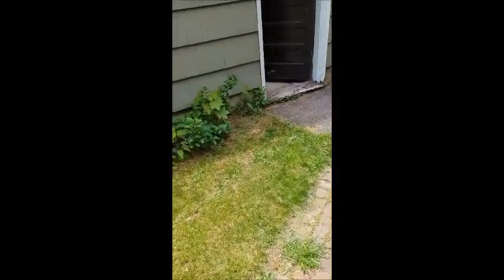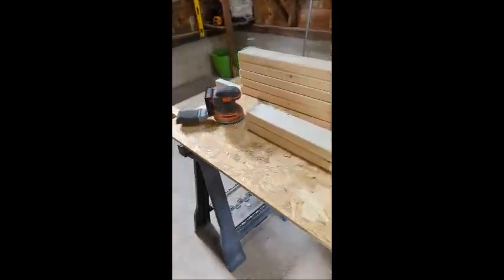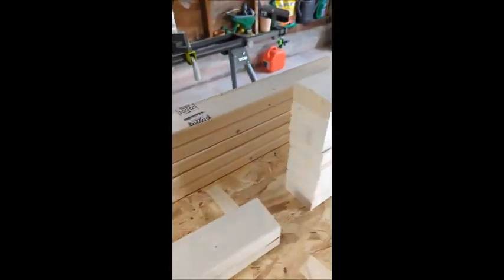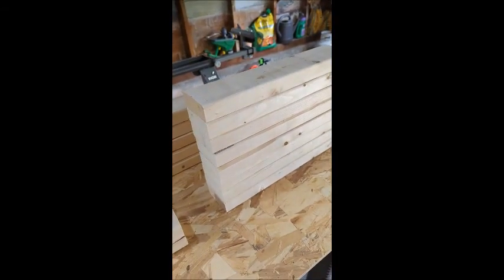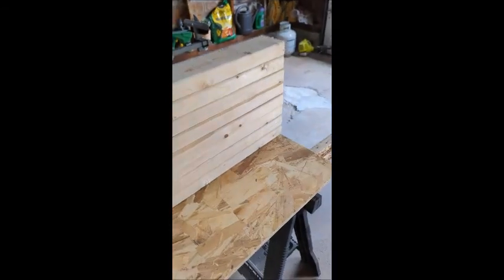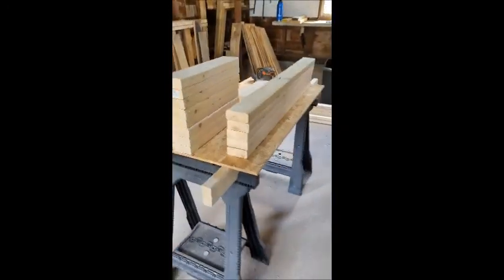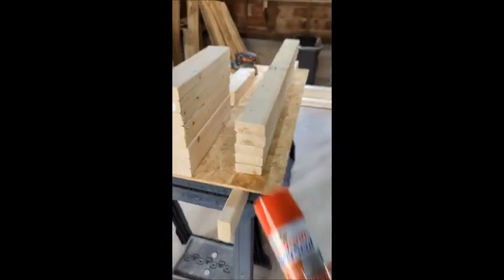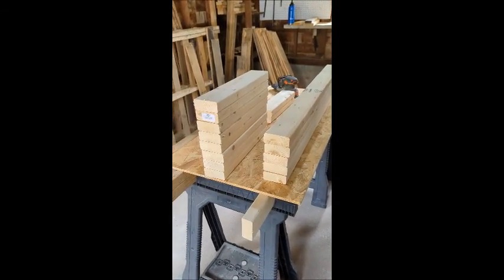Heading back to the shop. Not a very impressive wood shop — it's kind of a mess, I've got pallet wood everywhere. I'll save you guys the time of watching me sand all the grade stamps and splinters off these, but I'm going to sand them down. I'll stain the edges before I assemble it and go over and stain the whole thing, then hit it with a water sealer after. I hit that table with three coats of it. I'm just using aerosol Thompson's, nothing really special.